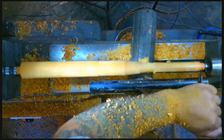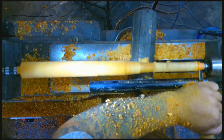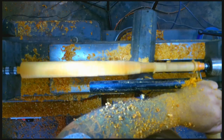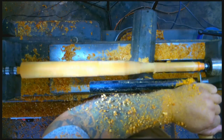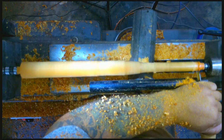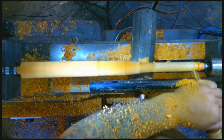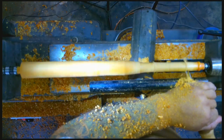Motion in this old lathe. I'm going to be procuring most likely a few sandbags to set down on the lower shelf. There's plenty of weight at the headstock where the motor and everything is. It's a big cabinet. However, there's no weight on the tailstock end at all. Well, I have a chunk of cherry burl in there right now to try and counteract the natural tendency for a little bounciness.